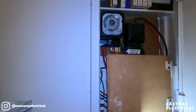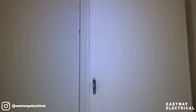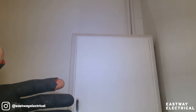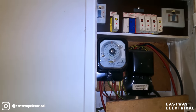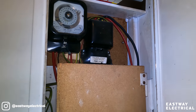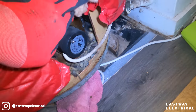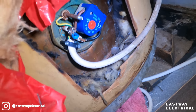I've got the fuseboard back in position and all the circuits are back on. All I can say is we've exhausted everything - the RCD is operating correctly. I couldn't see any fluctuation to suggest one of these circuits was faulty, and the insulation resistance tests all came up decent. The only thing I'd suggest is to get a portable appliance test done on all your appliances, because if it's tripping at night it could be something just plugged in overnight.